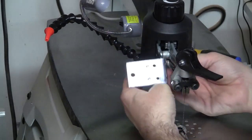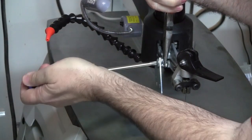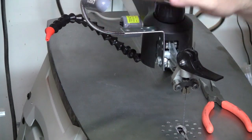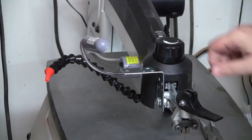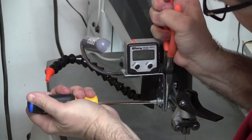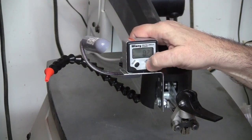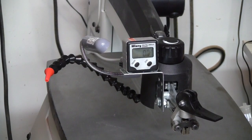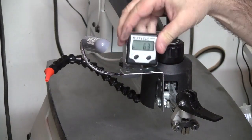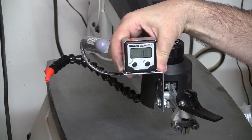Once you get it started, you can let the bracket hang down for a minute and just grab the locking nut and cinch it up a little bit. Then you can bring this up — I actually found that if you push it all the way back against this plastic, it brings it up at a slight angle that allows the Wixie guide to sit at a little bit of an angle and makes it easier to read. Once you get that bracket where you want it, snug it down real good and you're ready to go. All you have to do is make sure your blade is at 90 degrees, turn it on, zero it out, and you're ready to roll. I've run the saw several minutes and done quite a bit of cutting with this guide up here and it does not vibrate off — the magnets are strong enough that it stays in place pretty well.